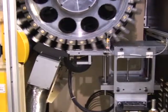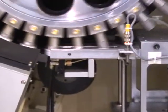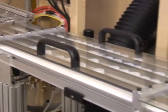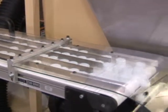From this point, the closures are mechanically and pneumatically ejected from the vacuum buttons into the stripper chute. Completed, printed, and UV cured, the closure progresses through the four-lane twist chutes to expose the printed surface for inspection or to be sent to a programmable count system.